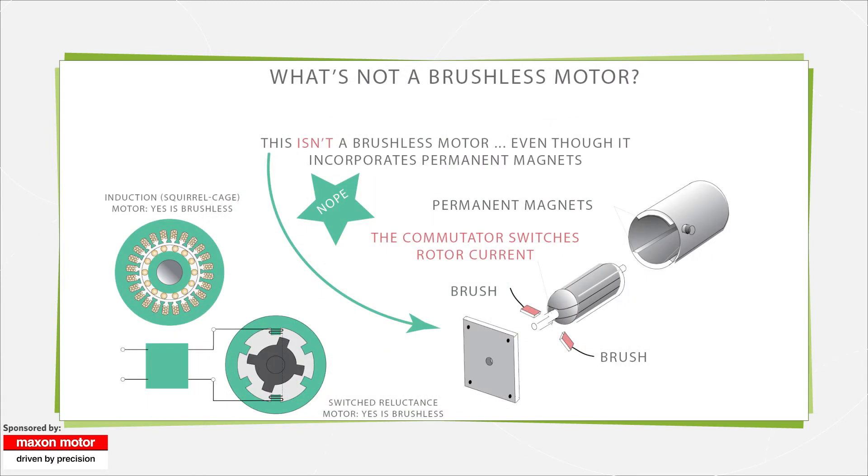Note that there are some naming convention caveats. There are permanent magnet motors with brushes for mechanical commutation, and some call these permanent magnet DC motors. Motors called brushless DC motors have permanent magnets, so they're technically permanent magnet synchronous motors, but run off AC from a DC bus and electronic inverter. Brushless DC motors, as they're called, don't run directly from AC lines. They can, with the proper drives powering them, replace the DC brush motors paired with drives in closed-loop applications.